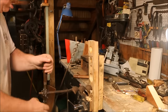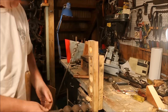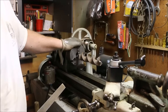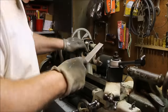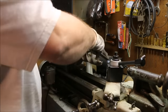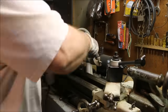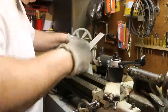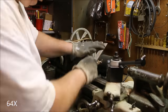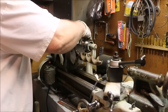The pilot screw is pulling good and the radial edges are cutting. But this time it strips out after giving just about 3/8 of an inch. Somebody sharpened this auger bit incorrectly — they filed on the outside of the spurs, which reduced the cutting diameter of the bit and made the flutes drag in the hole. After 3/8 of an inch in that harder piece of wood, it just didn't have enough strength to shear through. To make the auger bit work again, I'm going to have to reduce the diameter of the flutes by 30 thousandths per side.